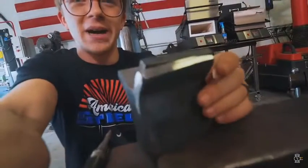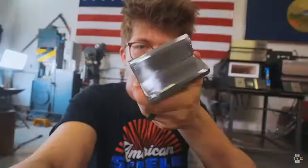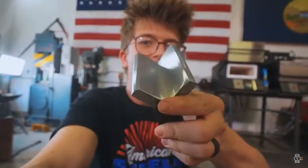Alrighty, so these are our parts. 1 piece of W1, thank you for grinding that wheel. 1 piece of mild steel, hot split down the middle. The next step is as follows. Mild steel piece is going in the forge. We're going to close it up to the point that we can force into it our W1 high carbon piece. We'll heat both up and forge weld them together.